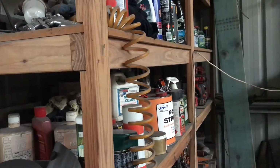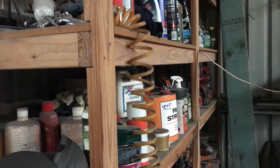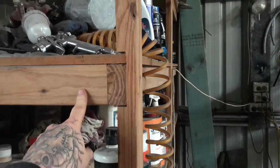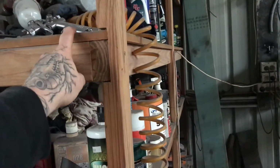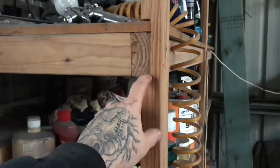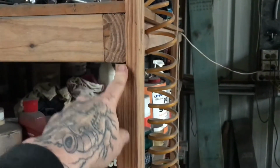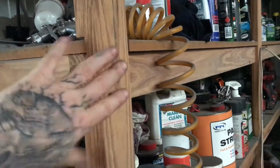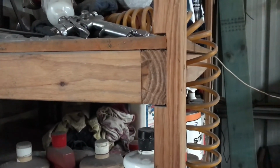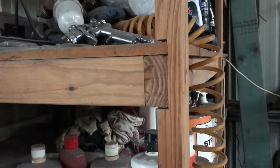I was just thinking about earlier when I was showing you about rebating RHS to make shelves. These are the cheapy timber shelves that I've got a couple of about the place. It's just made out of 35 by 70 framing pine and 19mm MDF. The cheapest stuff I could get. There's certainly nothing special about them, but by rebating all of the shelves into the leg, all the weight's actually on the leg. So these screws are only holding that against it. They're not actually holding any weight whatsoever. And that's the same principle that I was going for with the steel, just so the weld isn't doing all the work.